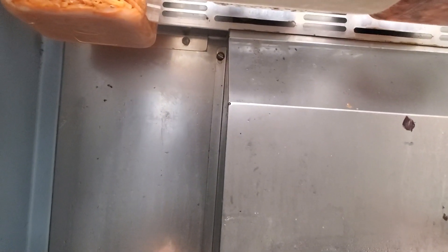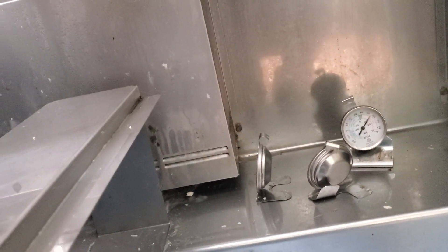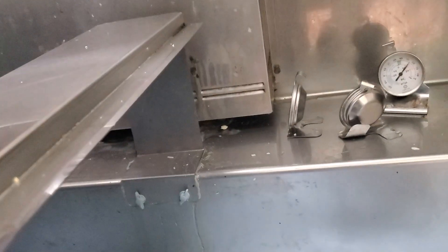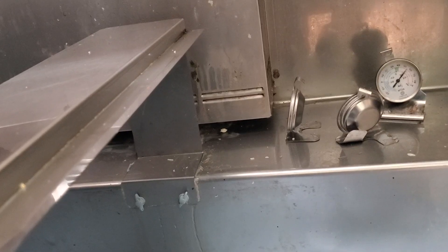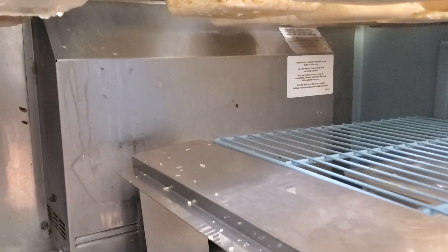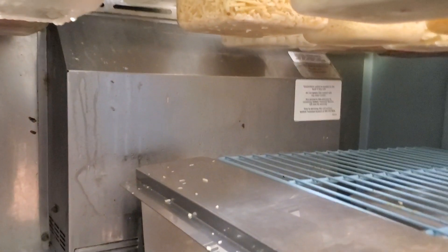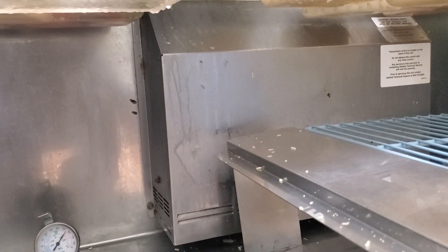What I'm going to do — you see the screws there — I'm going to release those four screws and take that cover off. We'll see the evaporator coil. And then from there, I'm just going to blow out the drain line, just like you do at your house. Clean it out. This one right here, we're going to have our vacuum cleaner suck it out, because it gets filled with a lot of trash. Then we'll blow it out and be good. Matter of fact, we've got two evaporators, so I'm going to do this side first, then the second side. And like I said, you can make a lot of money at restaurants doing the same thing you do at people's houses.